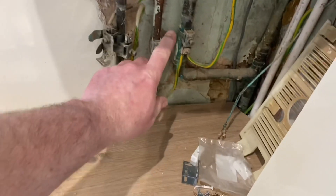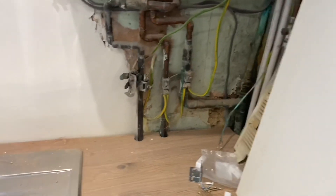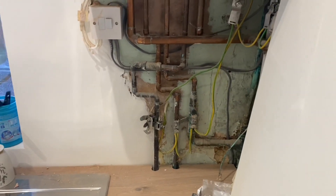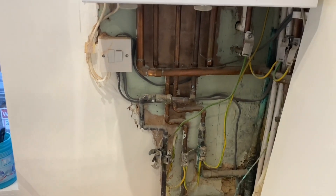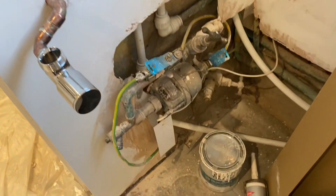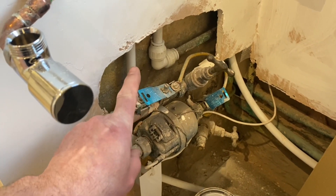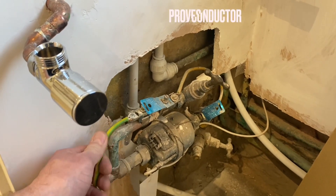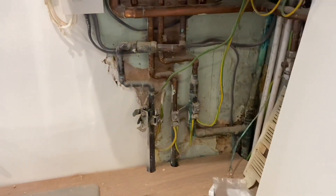In order to remove parallel earth paths for AM2, AM2S, and AM2E, you need to disconnect at both ends — disconnect at the clamp for the gas and disconnect at the clamp for the water — and then test your conductor. I would then like you to reconnect and test at the screw and the pipework, effectively doing the test three times for the gas and three times for the water. You record the highest reading. This illustrates clearly that if I test only with it connected, I could be picking up the return path from the gas rather than proving my protective bonding conductor is continuous.